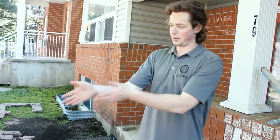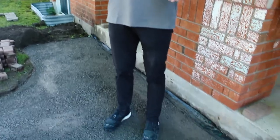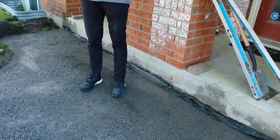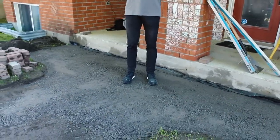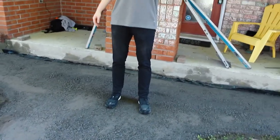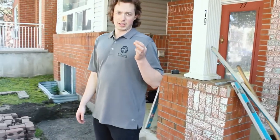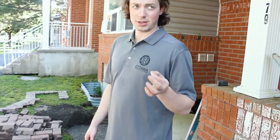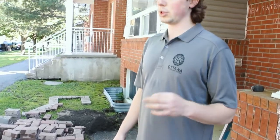So I just compacted it. It's a big compactor for a small area, not perfectly graded. Mid-compaction I paused, tried to regrade a little bit and redo it. There's going to be some divots — going to fill in with the stone dust. Not perfect. We're going to enter into the one part of the job that we do not do fully to code, because for some reason Ottawa landscapes are built off crushed stone gravel and limestone screenings.